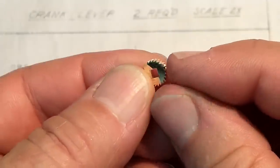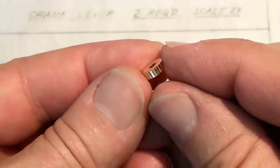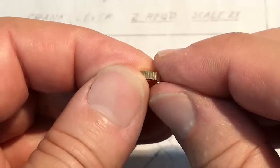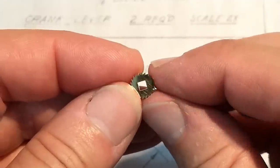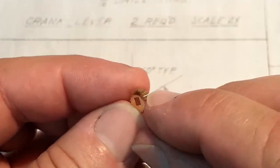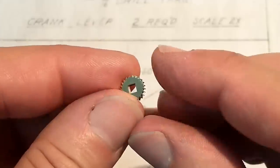I've got to say, I really enjoyed doing this one. I knew it was going to be very unconventional, and it is extremely small. It takes me back to the days when I actually used to make watch crown dies for stamping watch crowns out of brass pellets — that's where I started my apprenticeship, in a company that made watch components. So this is like going home again. Anyway, there you go: 24-tooth gear, 0.325-inch diameter — that's about 8 millimeters — 60 degrees, with about a 5-thousandths land between each tooth and a 0.1-inch square hole in the center, that's about 2.5 millimeters through the middle. I'm very pleased with the way this came out — a little bit of trial and error on the insert to get it not to swell up as I cut. If you have any questions or comments, please leave them in the comment line. Thank you very much for coming. I hope you're happy and well wherever you are in the world. It's Joe Pie, Advanced Innovations, in Austin, Texas.